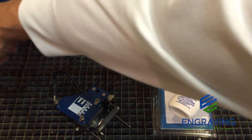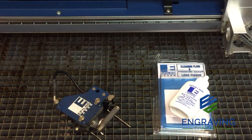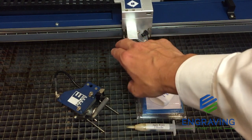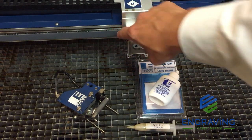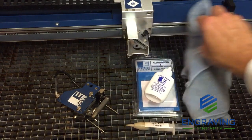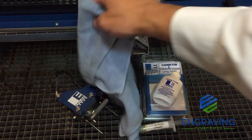This is a really strong linear guide that operates at a very fast speed and is very robust — we just want to keep it clean and lubricated. During laser engraving, dust can flare up around either side of the lens assembly and get caught up on the belt, so always keep the x-axis belt clean and free from any dust or residue. You can use a rag, a shop towel, or some water and liquid detergent to keep that area clean and dry.